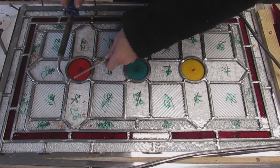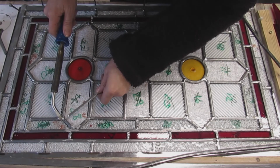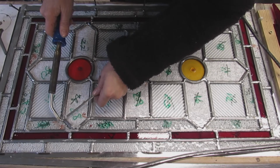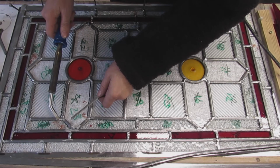But it's not tricky, it's not too difficult, and there's such a lot of soldering involved that you'll get all the practice you need. And you'll probably use too much solder at first, but that doesn't really matter. Again, these joints are a bit dull. If it really doesn't take, you're going to have to scrape away at the surface with your wire wool or wire brush.